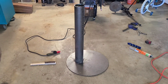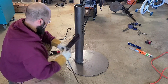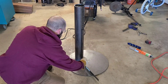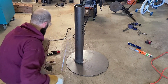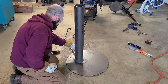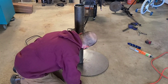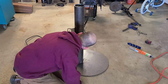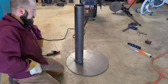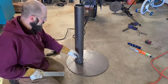Let's check it one last time. Beautiful — slight gap on the bottom, barely any light going through that gap. Very nice. Same on this side. Look at that — beautiful. That is how you square a piece of tubing or pipe to something flat.